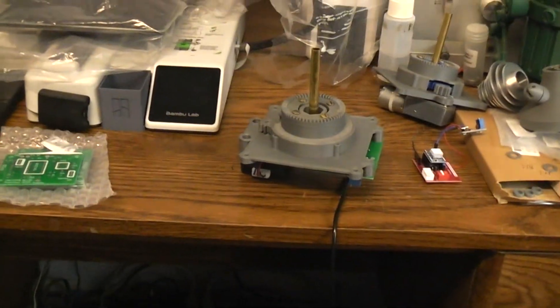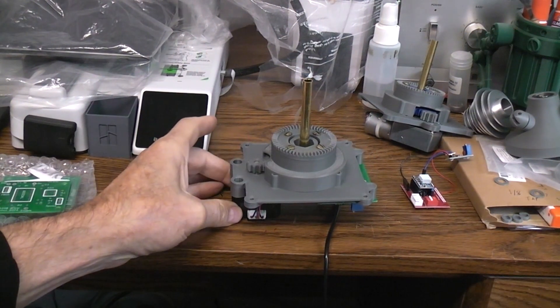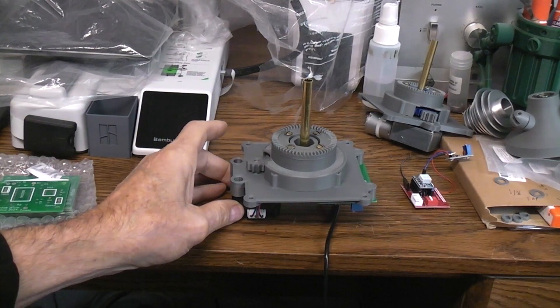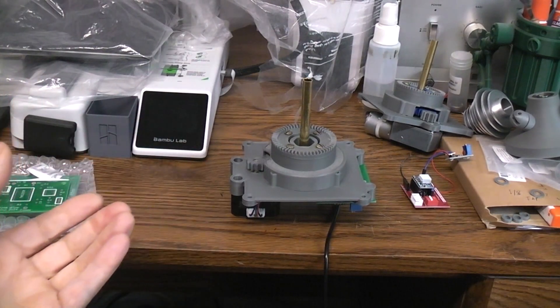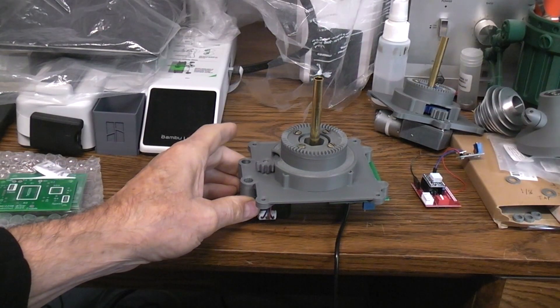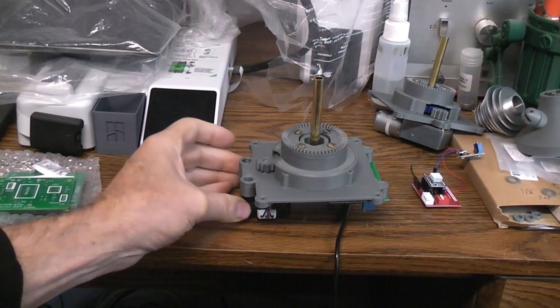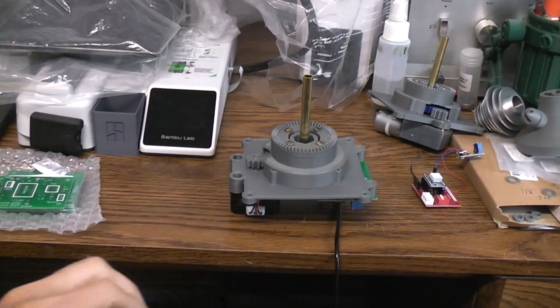On this project, if you were going to use a stepper motor, the main reason I'm using one is that stepper motors don't have any brushes. All your other motors — toy motors, TT gear motors — aren't designed to last as long. A stepper motor can run 24/7 because there are no brushes. The only thing that can eventually wear out would be the bearings on the shaft.